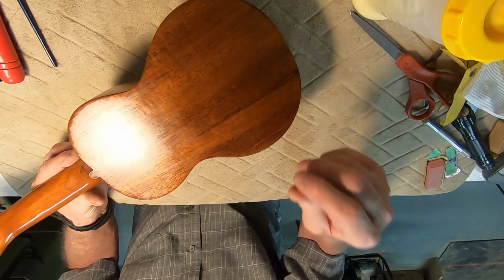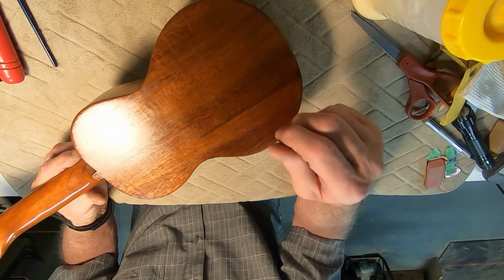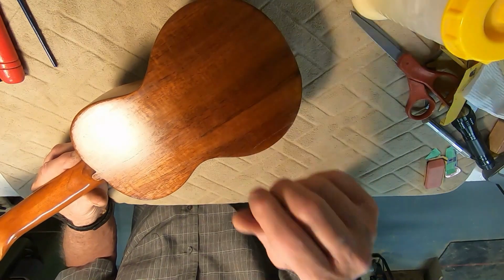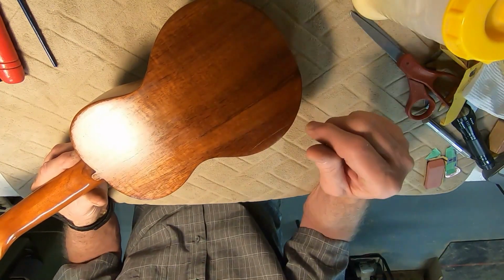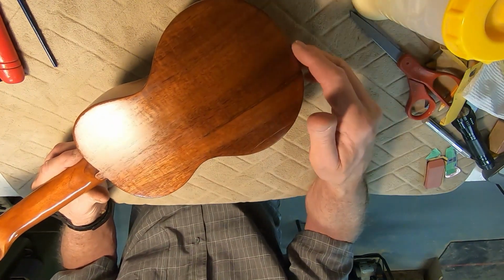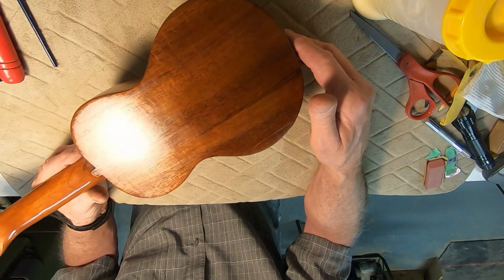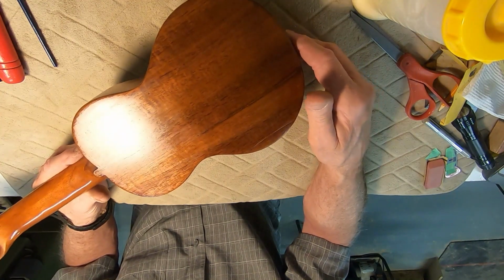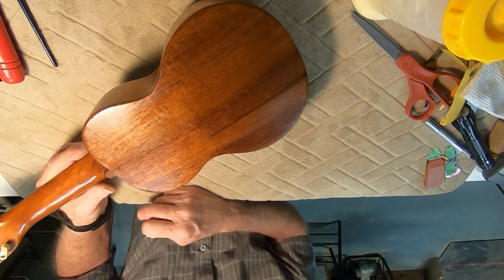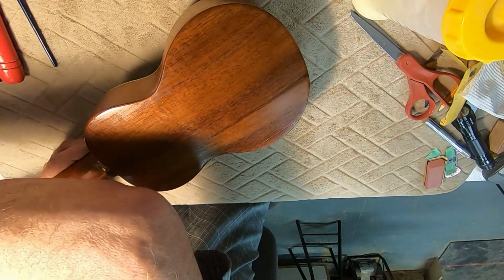I actually made up a little rubber, they call them, for French polishing. But I didn't polish per se, I just drug it across. Kind of went in on one end and then in the middle out the other way. That was a little rough, so I pretty much sanded with 400, 600, 800, and then I still wooled it with triple aught brass wool or bronze wool, as it's called.